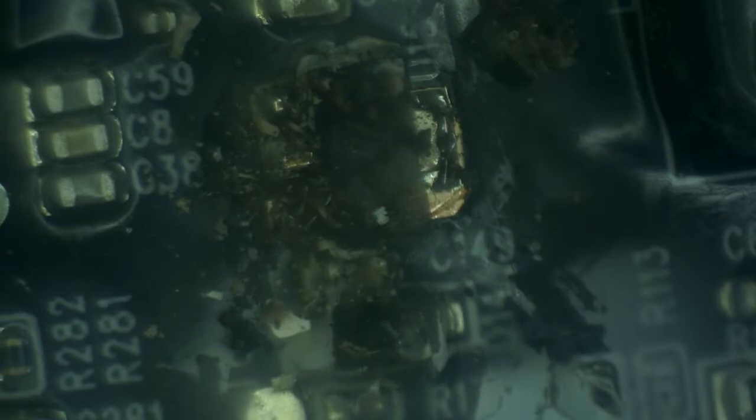I can actually see if I can make out the value on this. There is still some markings left. It does look like it says 7533 on it. 33 likely stands for 3.3 volts. And I realize, of course, that you can't see any of it. So yeah, this is the logo, and then 7533. That's what's supposed to be in here. You can tell, hopefully you can see this, that the pads are moving slightly, so the last bit that's left is the pad underneath.